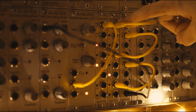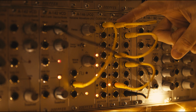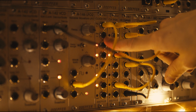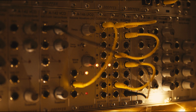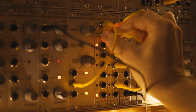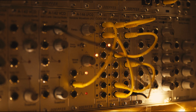So a few caveats here. This very basic sequencer will always loop through exactly eight notes worth of length, and it just keeps on looping forever. If you want more than eight notes, or less than eight notes, it cannot do that as far as I'm aware — unless you fed in a reset signal. Actually, now that I think about it, we could take the output of this and feed that into the reset signal. If we want to make it, say, five notes long — we can make it four notes long by doing that. So it turns out you can make it shorter than eight notes, but not longer.